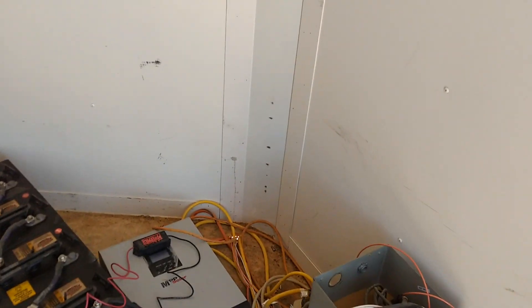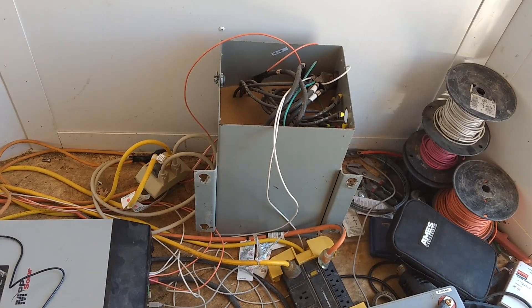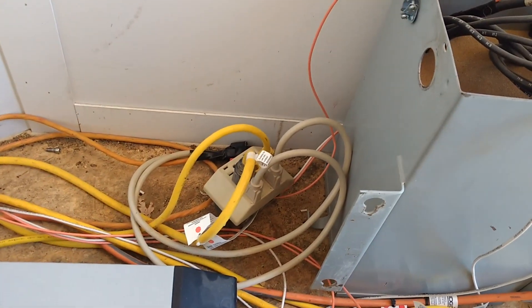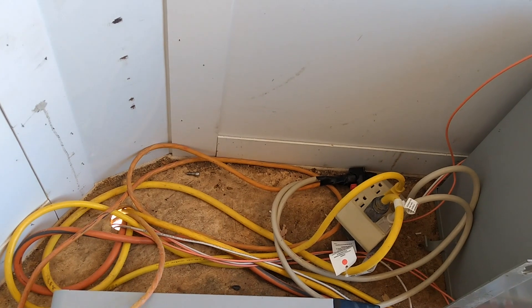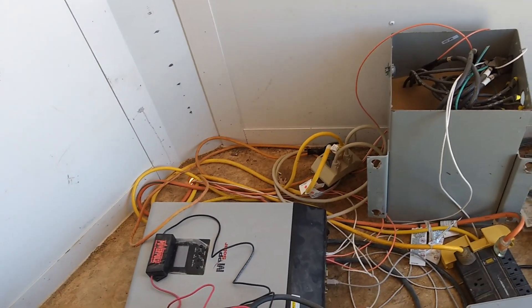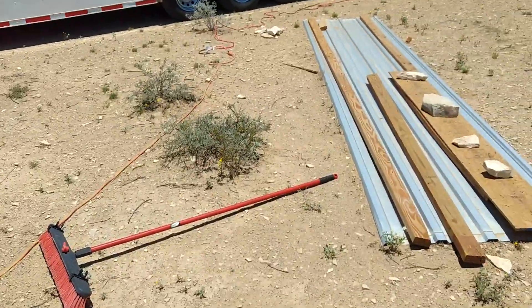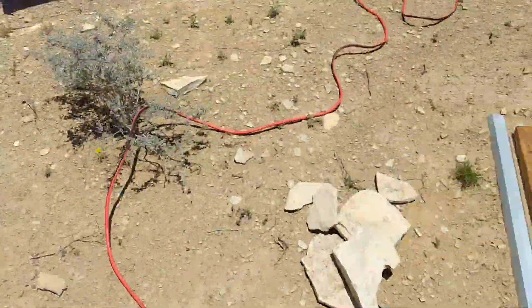So here's what I've done. I have our 240 volt inverter connected to a transformer, which gives us our split phase output — it's basically a center tap output transformer. And then I have my two phases over here, and those two beige-ish color cords, their hots go onto the hot and neutral conductors of that little orange extension cord, and their two neutrals go onto the ground. So I'm basically treating this thing as a 240 volt extension cord. I know that's not technically safe, but because I've got fuses on there and the most it could ever draw is 10 amps, it's okay. The only big gotcha is I need to make sure nobody ever plugs into that outlet with a standard device because it'll just blow it up.